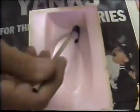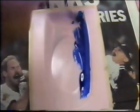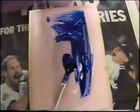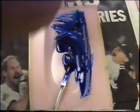Okay, now whether you're doing polyester or epoxy, you see it's not going to stick to the siliconized rubber. So step one is to get a nice little coat in here. Now, if you're doing polyester, you could use what they call gel coat to get a pre-finished part. Well, that's of limited value to us since we're going to put a finish on this anyway.